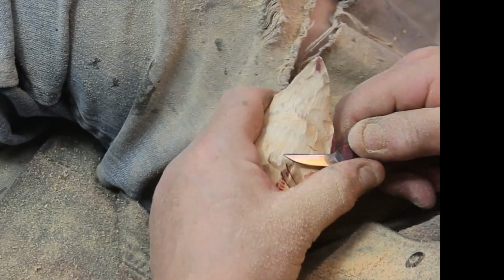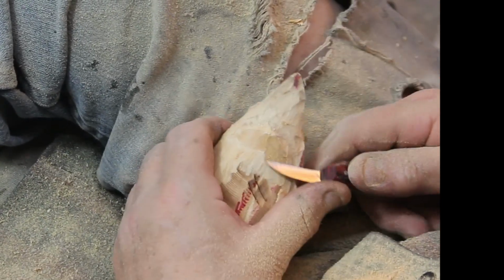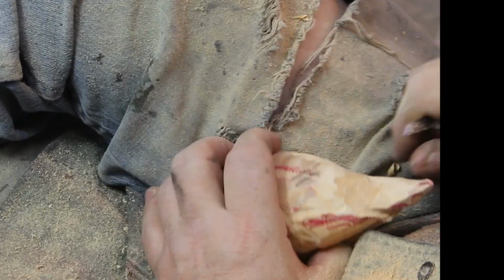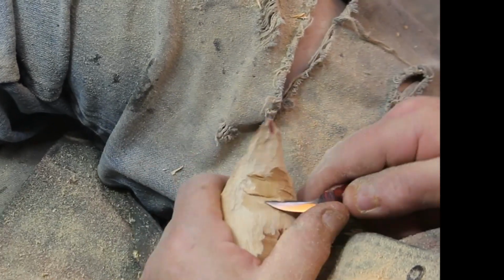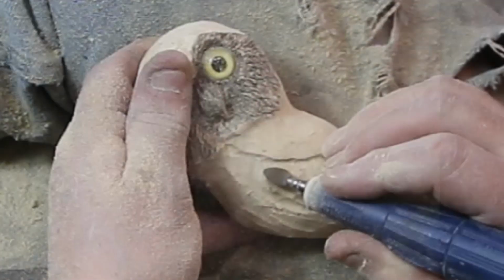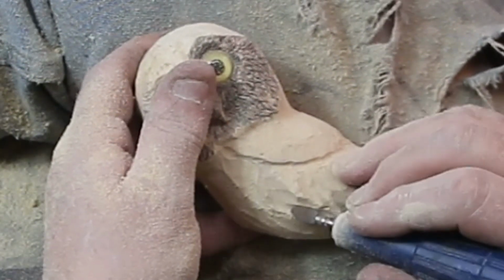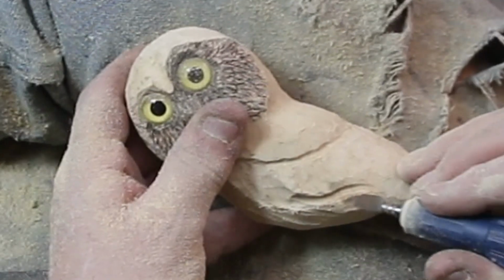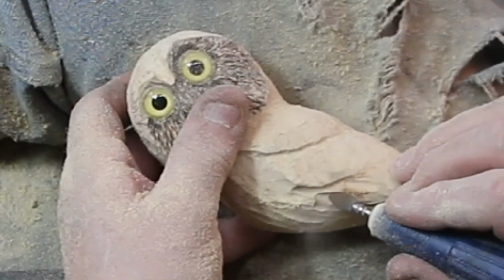Example, anything with legs or hands or an appendage that goes in the 90 degree angle from the other, that grain is weak right there and will break off. You want to carve that appendage that sticks out with the wood grain going lengthwise on it. That's the reason they split wood in the old days for chairs. The wood splits right down there and you get some really fine Windsor chairs out of oak, typically, or ash that have phenomenal strength. That's just because the wood grain goes down through there.